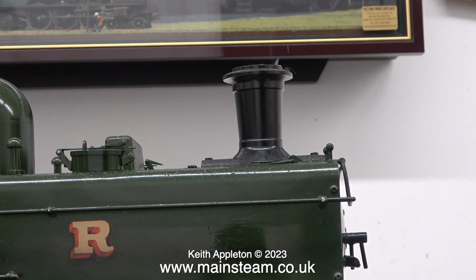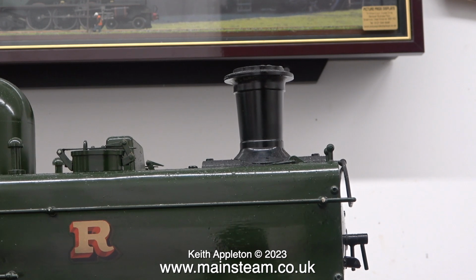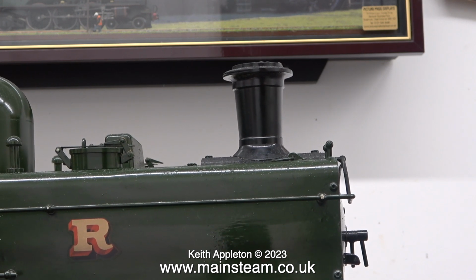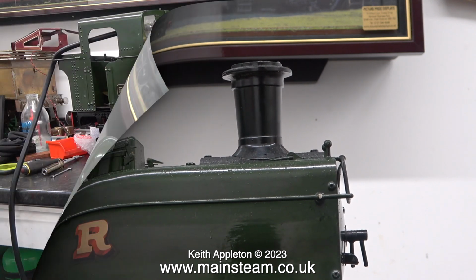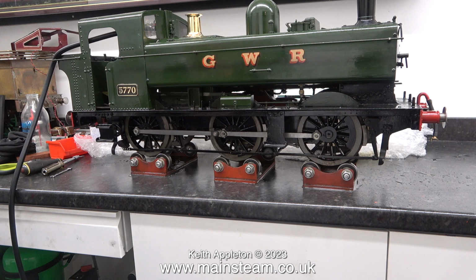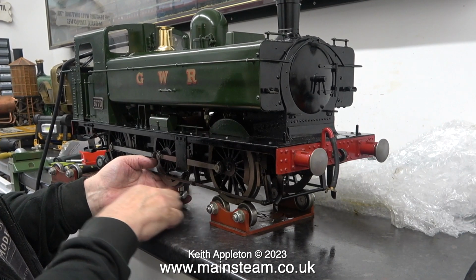The knocking is partially due to the over-tightened suspension and partially due to the fact that the boiler is overfull and water has gone into the cylinders and is blowing out of the chimney. I did notice there was no hydraulic lock, so the drain cocks on this engine, even though they are a bit bizarre, do appear to work.